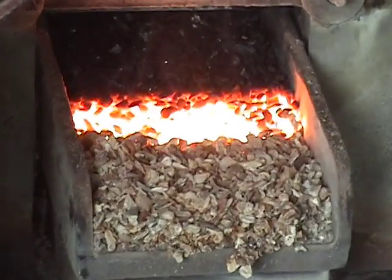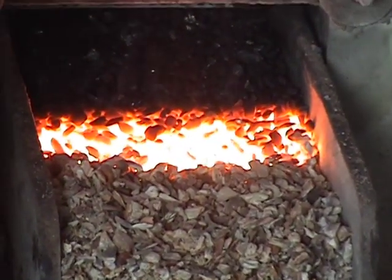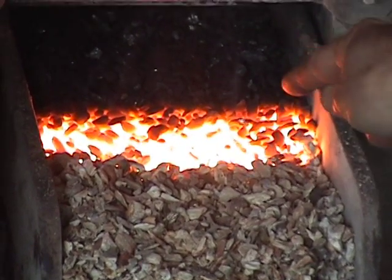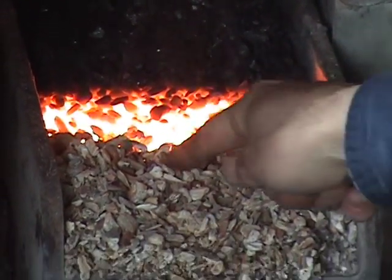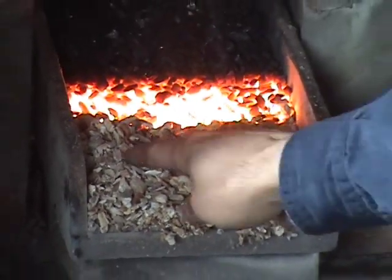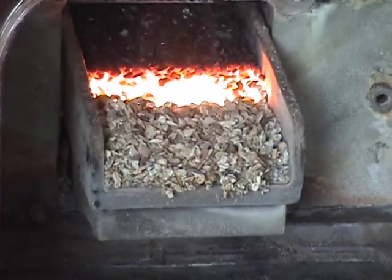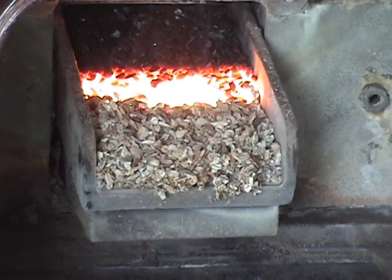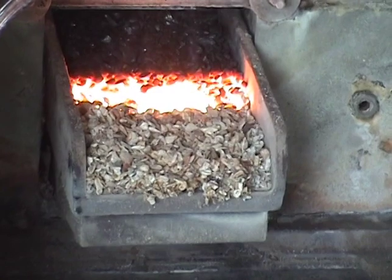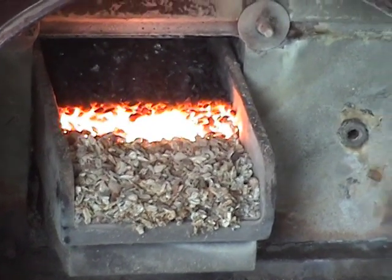You can see now that the stove's been burning for a while and you have a band of fire. The length of that band can be increased down to within an inch of the edge. As long as you maintain at least an inch of dead ash, you're not wasting your coal. Once you start pushing hot coal over the edge, you have the stroke up too high and you're wasting your coal.